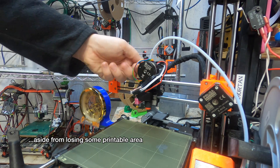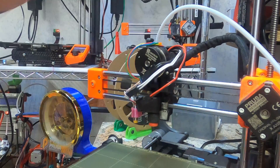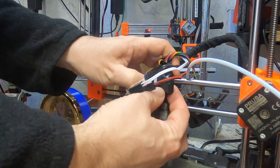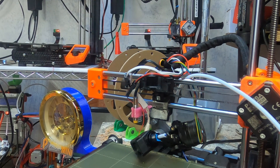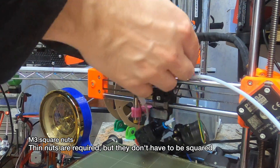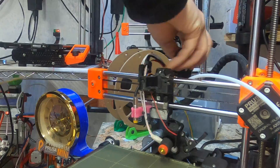I want to redo the install. So holding the Orbiter on from the top, two M3 by 20 millimeter flat-end screws. The Revo is held in by its included nut. The mount is held in by the original screws with two square nuts up at the front. The top screw is easily accessible, but the bottom one is hidden by the fan, so you have to remove the fan to get at it — that's right here in the fan duct.